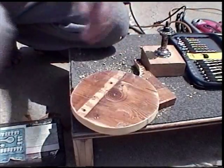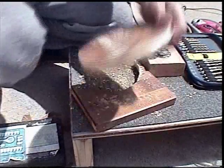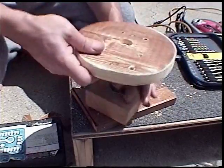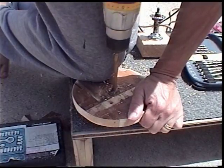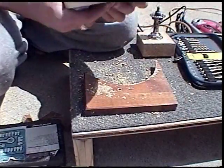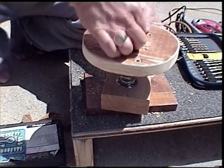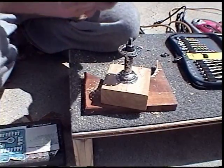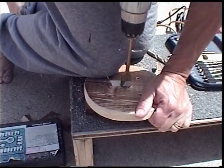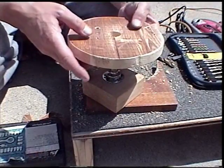From the underside, I'm going to make a slot for the nut to fit in — not going all the way through — because the nut of the axle sits on one side and the nut that goes on the axle sits on the other side. I'm making it slightly bigger with a regular drill bit, making sure it sits down below the level of the actual top surface of the wood. I saw it wasn't quite level, so I'm trying to level it out a little by angling the drill bit. That looks pretty good.